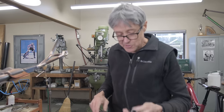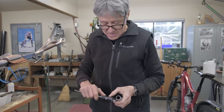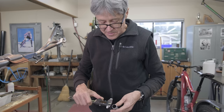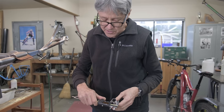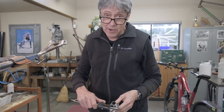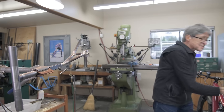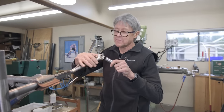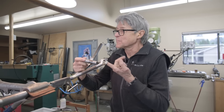I've got a 7/8 tube here. It's chromoly, so it's usually nicely made. And the size is 874. Okay, that's good. A thou undersize. So we'll see if it fits. I'd kind of be surprised if it does. Feels like it's got grunge in there.